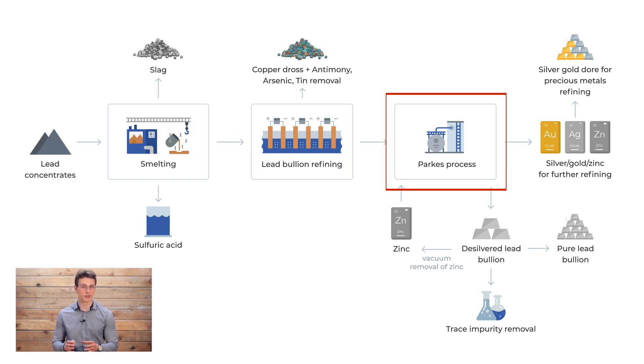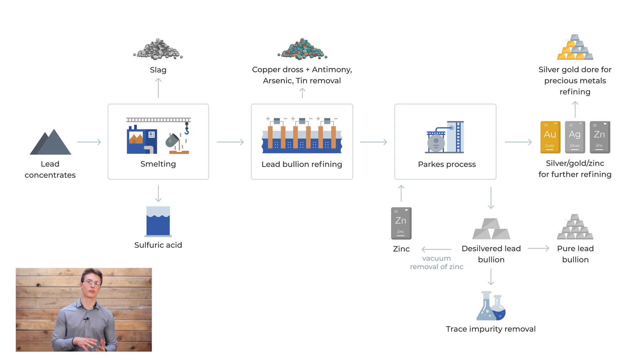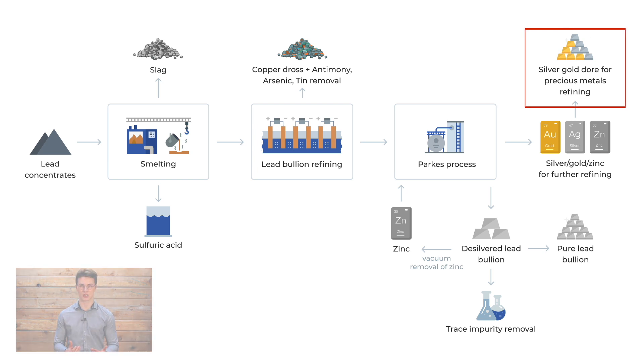The remaining gold-silver alloy typically has a 99.9% purity. To separate the gold from the refined silver, a process known as parting is used. The most commonly employed method is digestion of the alloy with nitric acid, wherein the silver is dissolved, the remaining gold is washed, and the silver precipitated from the washings as silver chloride by salt addition.